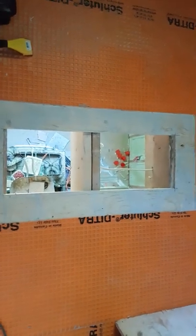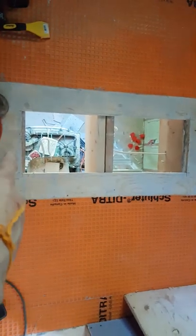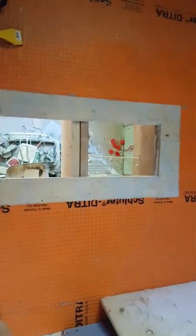I've opened up the spot — the original issue was here and extended just about to there. I took another joist just to be on the safe side. When you patch like this, you're supposed to hit one, two, three joists in order to make sure that the wood is stable and doesn't creak.